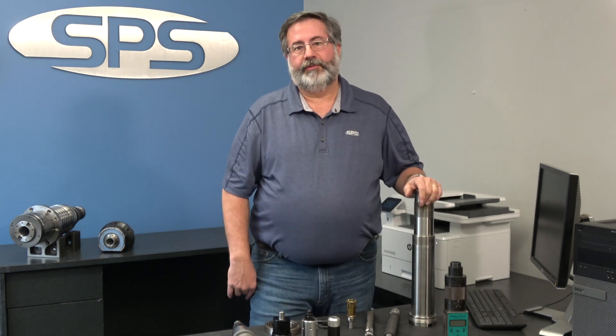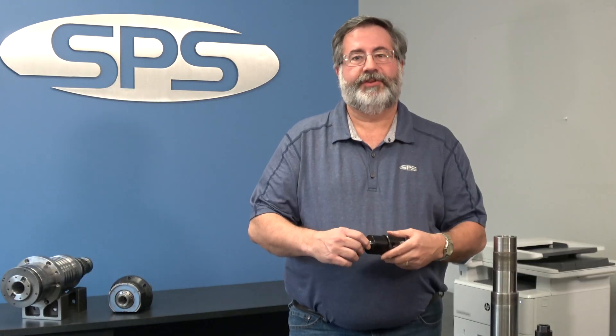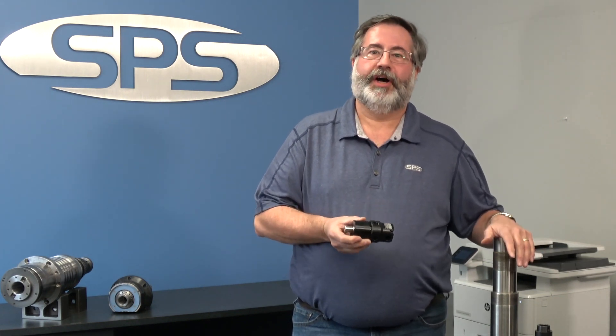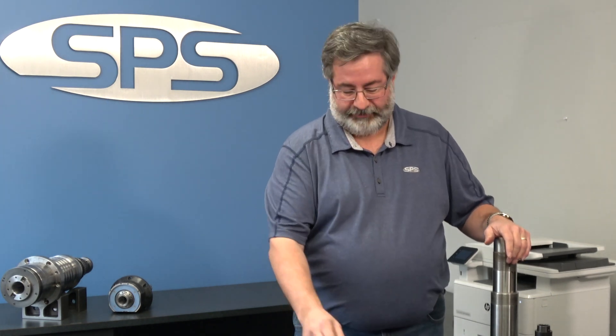Here I have a sample of some rotary unions, and essentially these rotary unions are mini spindles — they have bearings and they spin. So if your spindle has 10,000 or 20,000 hours on it, your rotary union has the same amount of hours on it, so you really should address that and correct or fix them.